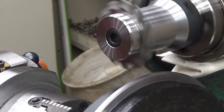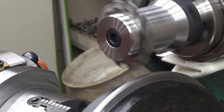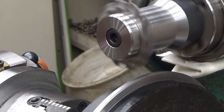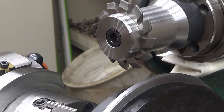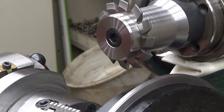Then I pull it here, somewhere. Well, yeah. Now I zero my Z-axis dial here. Put it to zero, and then we need to lift the table the amount of cutting depth. 2.166 times 2 equals 4.33. Let's take a safety distance here.